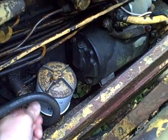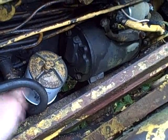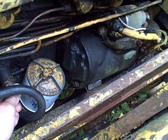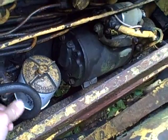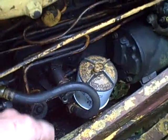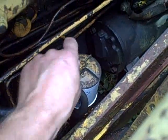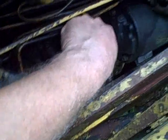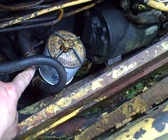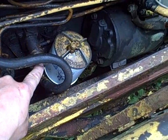Nothing's coming out of the bleeder, and I noticed when I would operate this hand primer it didn't feel like it was ever building any pressure. But is there actually no fuel flowing through here? I don't believe that's true because I cracked this fitting open, cranked the engine, and it worked fine. And when I put the electric pump on, it pumps fuel out through this breather. So I think the hand primer is not working at all, but I don't think it's actually blocking fuel flow — I'm going to confirm that.